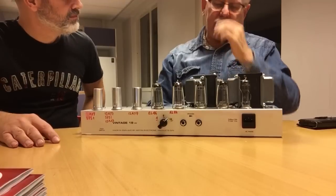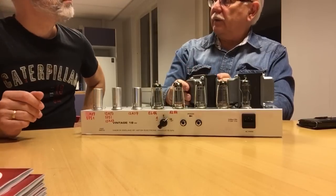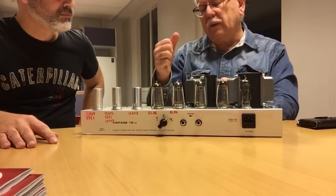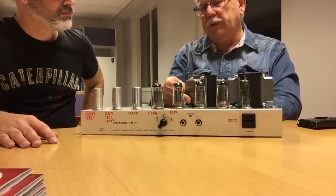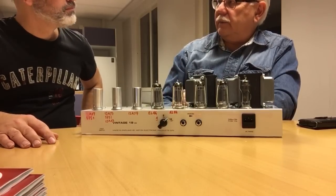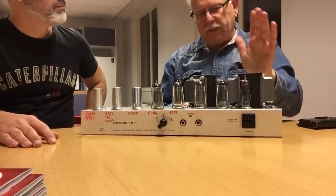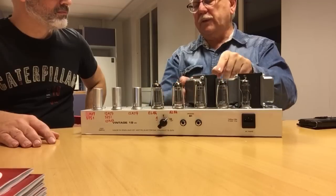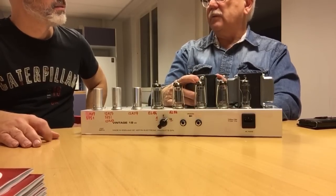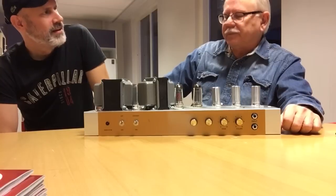I tweaked it, because what I do is a very simple thing. I have the transformer not connected to anything in the circuit, because the first thing I do is placement. I have a transformer in my hand, and I connect headphones to the output secondary winding. And I power up the power transformer, just connect to the mains. I know it leaks magnetic field. Then I move the transformer, turn it up and down, and we listen. Where the hum almost disappears, it's very seldom that it will disappear totally, there will always be something, I find the minimum level of hum.